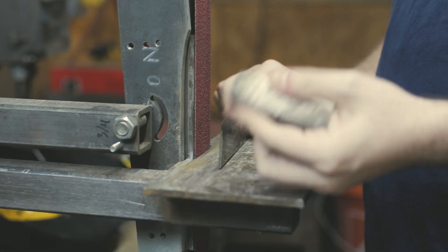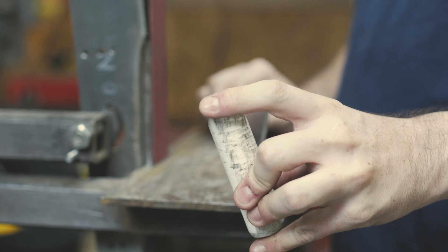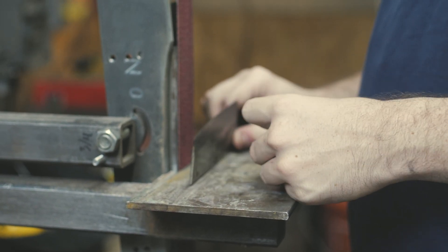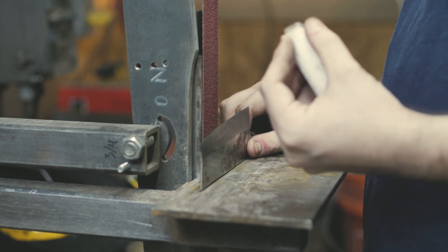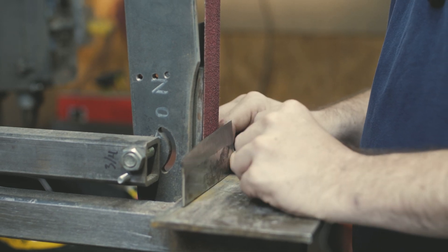Don just explained his technique for thinning the edge, which if you're an advanced grinder you can try out — you might fail a couple of times and burn blades. I'm going to show how I do it if you're a beginner and you don't want to burn blades trying to apply the right amount of torque. We have this Teflon push stick that has a really aggressive angle with a very defined pointed bit — you grind it down to the shape you want. This specific push stick is how I deliver the pressure for thinning out an edge. Generally if you're a newbie, you do want to save a lot of thinning for the disc because doing this is quite all-or-nothing and can ruin your entire piece of steel.